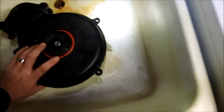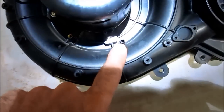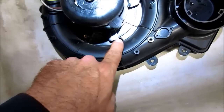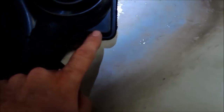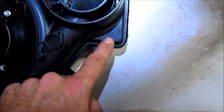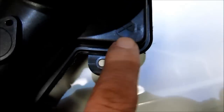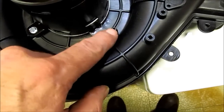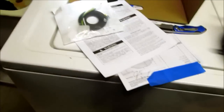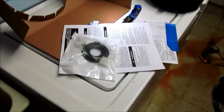Now, in a previous video I had to drill the port on this one, and I had to drill it out for a bigger port size. And if you notice right here, there's no X - so this is an older style inducer housing or motor. Now if you come here, there's an X right there. That's telling me that port's enlarged on the back side of this, so it doesn't catch water. So let's get the inducer motor in.